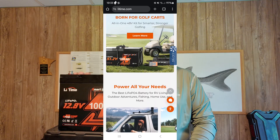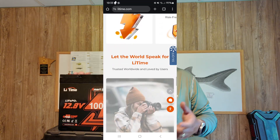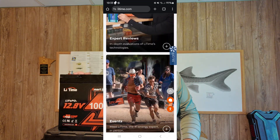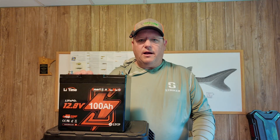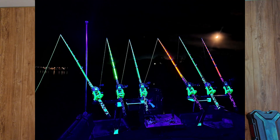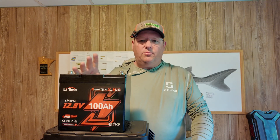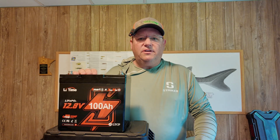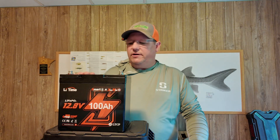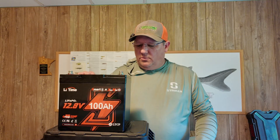I do use a lot of 12 volt power in the boat — UV lights, charging batteries for phones, tablets, laptops, whatever. I have a lot of people in the boat and we're always looking for power. The UV lights draw five to seven amps and sometimes I have these running six or seven hours a night. So this 100 amp battery will mostly power those lights, giving us 15 to 20 hours of runtime — a lot less charging and a lot more emergency power.